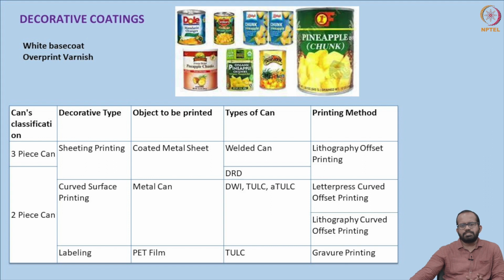It is basically a steel sheet with a polyester laminate on both sides. It is manufactured using a dry forming method, so no lubricant is needed. So the steel sheet comes with polyester laminate on both sides; at the time of manufacturing itself, the sheet is coated with polyester on both sides. That eventually results in less carbon emissions for that particular can. So that is called a TULC can. That is the new kind of canning system being made. Since it is coated with polyester, the bisphenol risk is not there. Such interventions or inventions are being introduced right now.